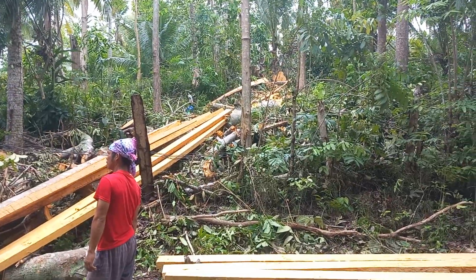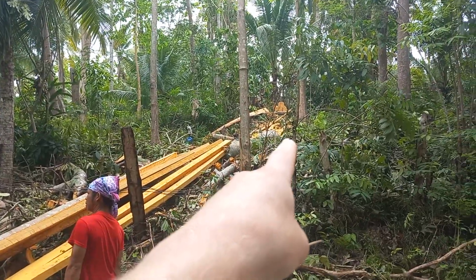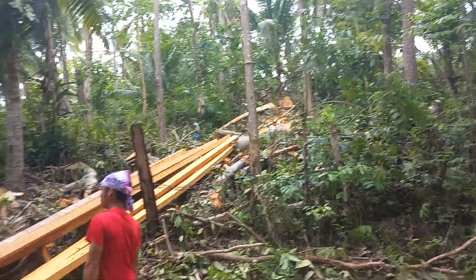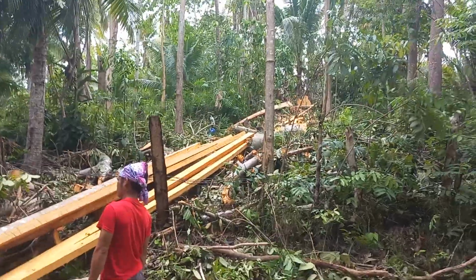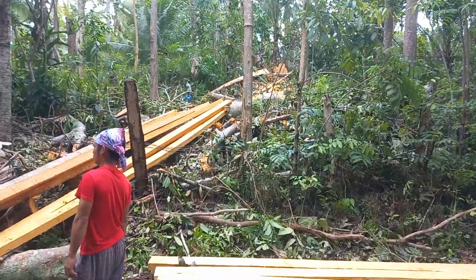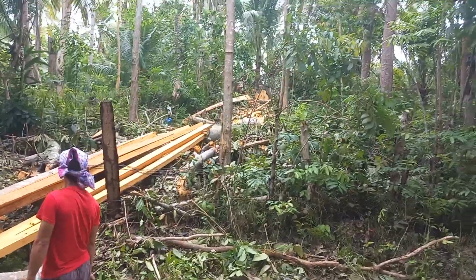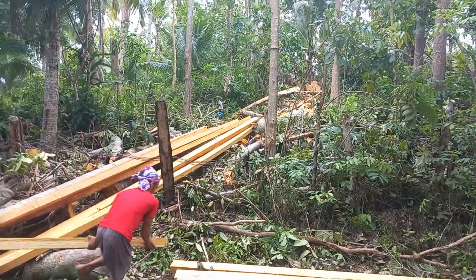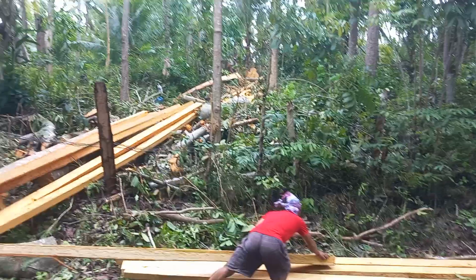used for other construction. And on top there's another log, which is a 12-foot log, and another log below there. So the 12-foot log, I've actually drawn a picture of exactly how I want them cut. This 12-foot log here, I'm going to get them butchered up to 3-inch. It's best to work in factors of things, so things fit together. So like 3x3s and 6x6s, or 2x4s and 2x2s, that kind of thing, so that when you fit things together, they match together.